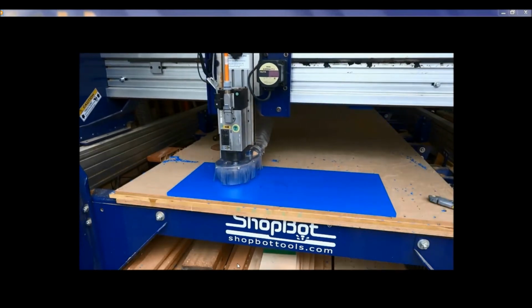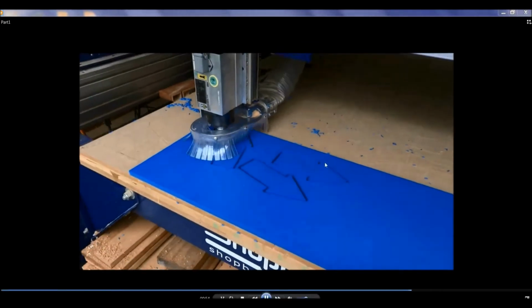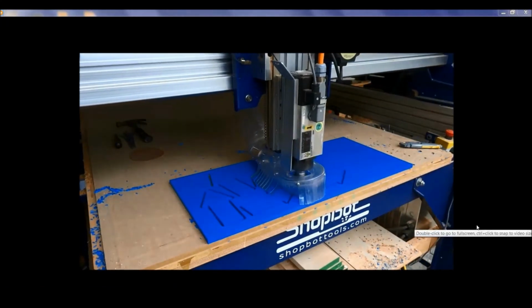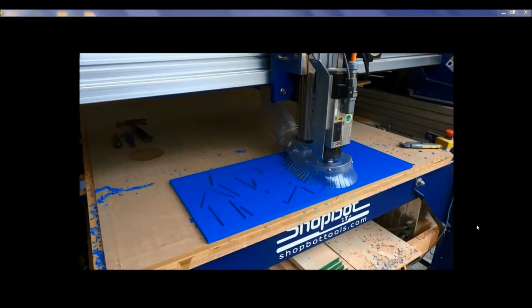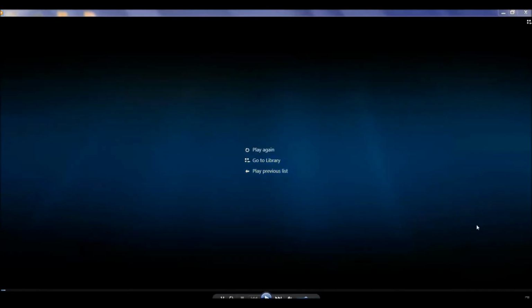So can our parts be rotated within the material? We also need to see how much of a border gap we can leave right here along the edge. Depending on your vacuum hold down or how close you can get to the edge, you really don't want to be cutting out into that area and having an open cut off the edge. These are the kind of things we have to start thinking about before just clicking on nesting and hoping it's going to make it all happen for us.